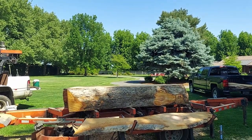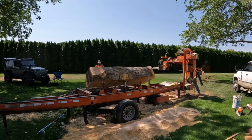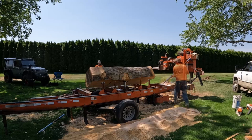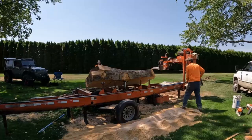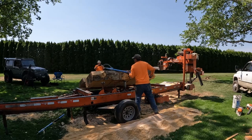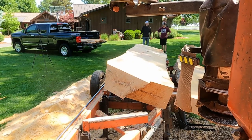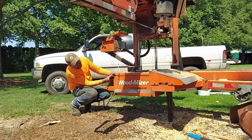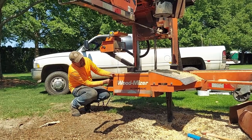Is it going to be the best, most high-grade sawn lumber you can get out of the log? No, it's not. You're going to get some good stuff out of the center. For example, if you come out of the center, you're going to have some vertical grain, and if you cut the heart out of it, hey, it's going to be great. But if the customer wants 2x cut out of it and as many as they can possibly get in the shortest period of time they can get them, well, guess what? This is what you're going to do. And it may not produce the highest grade, but it's going to produce what the customer wants,